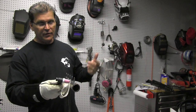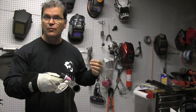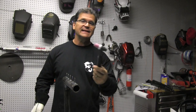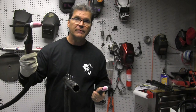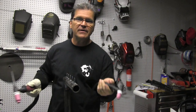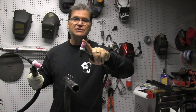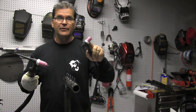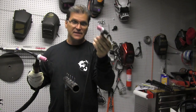Let me go over the key points as well as some things I sell on the Weld Monger store. TIG finger — for jobs like this where you don't have a lot of places to prop, you can prop right next to the weld and it helps you steady up and move along nice and easy without your fingers getting hot. I also used a stubby gas lens today on a stock 17 torch. What a stubby gas lens does is shrink the torch down to something almost as small as an air-cooled 9, and you get better shielding — you can use the same cups as a standard number 9 or 20, get better shielding, extend your electrode further, and have a nice manageable size 17 air-cooled torch.